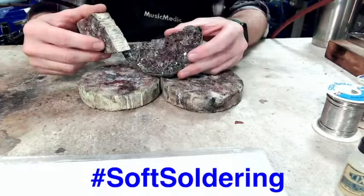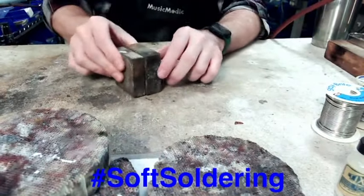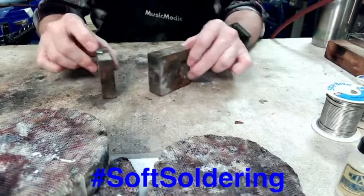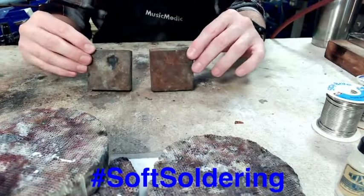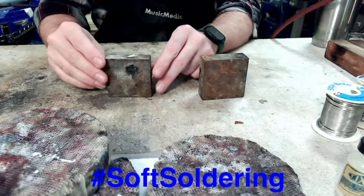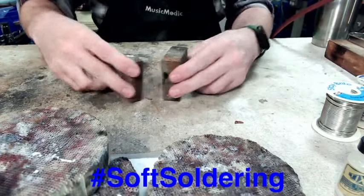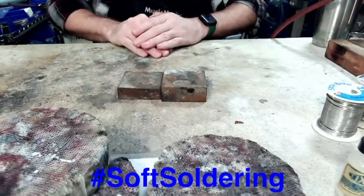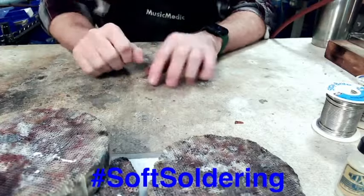And you can see I have a bunch of broken pieces and whatnot. I've also used old bench blocks for holding things. And you notice these are old and rusty. That is what the flux will do to that steel. So don't use your good bench block. Keep a separate one on your bench for leveling pad cups and doing whatever else, flattening springs. And I use these two over here at the soldering bench for holding onto parts or just being able to put something on top. That works very nice. So Ryan, continue.